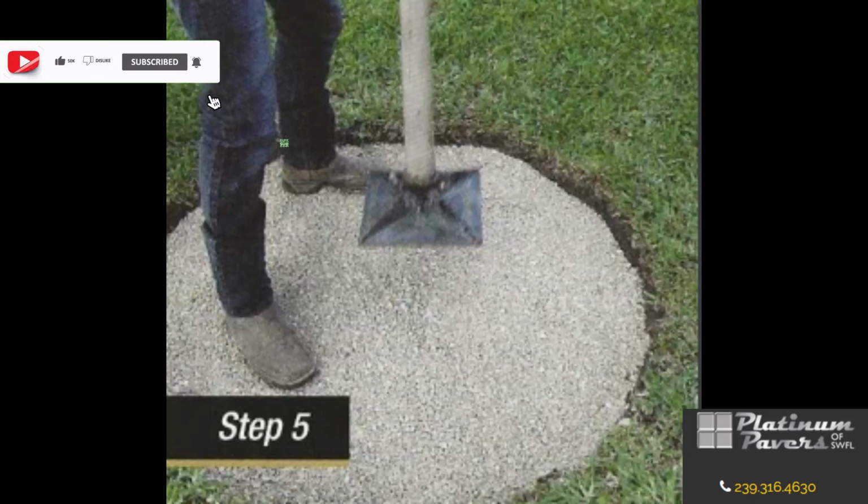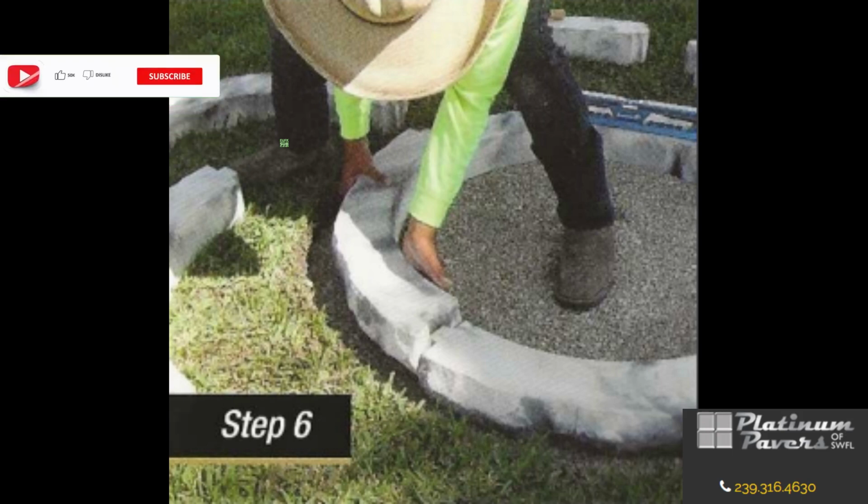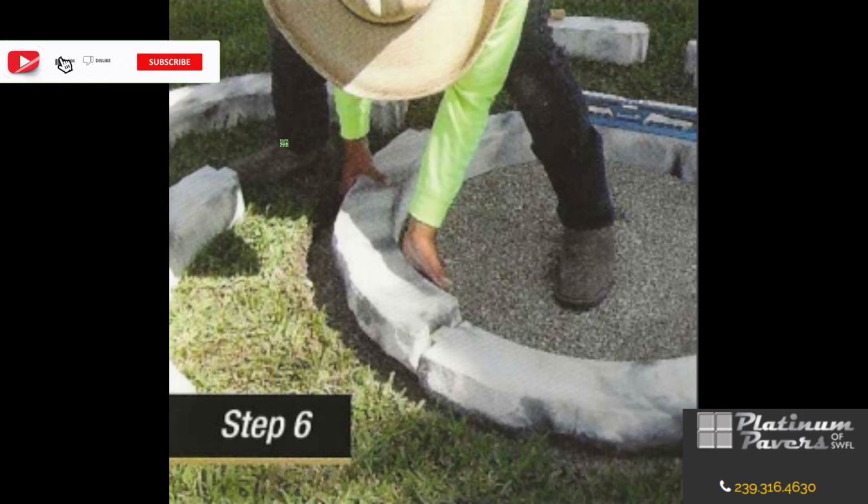Step 5. Tamp down gravel stone, keeping it level. Step 6. Place first course and use rubber plastic mallet to establish a level bottom course.